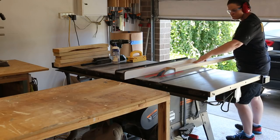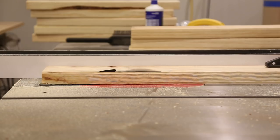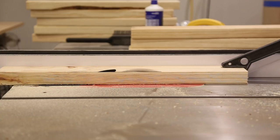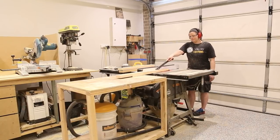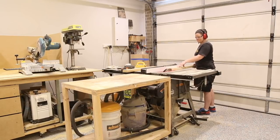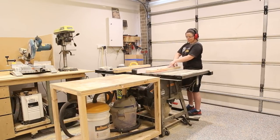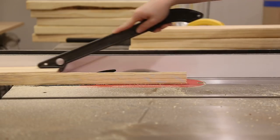While I'm doing this boring part of the build, let's take a second to go over the workbench dimensions. The framework and base of the workbench is just shy of 1.9m long and 810mm high. The casters I'm using are 100mm, so I needed to take this into consideration when designing the workbench. When deciding on the height I also had to take into account the miter station, as this will ultimately become the workbench surface and I didn't want it to be too high.